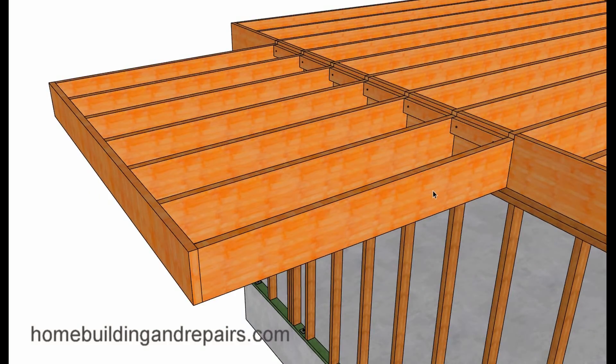So here we have the balcony. It will also slope — we have a one-inch drop, and that of course is to help waterproof the balcony from the home. A one inch would be the minimum.